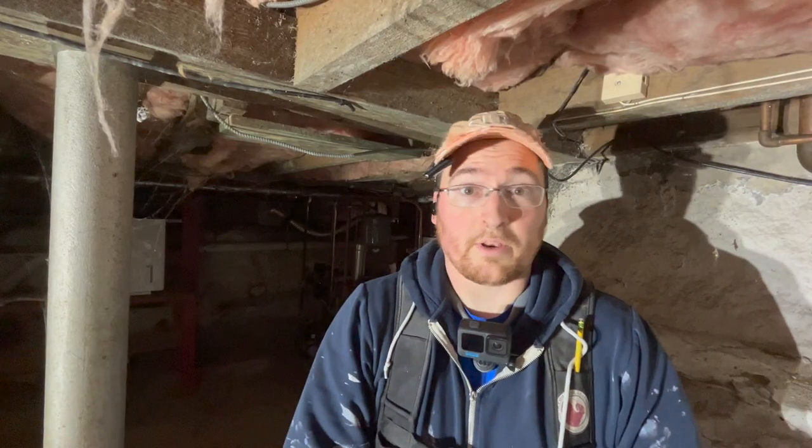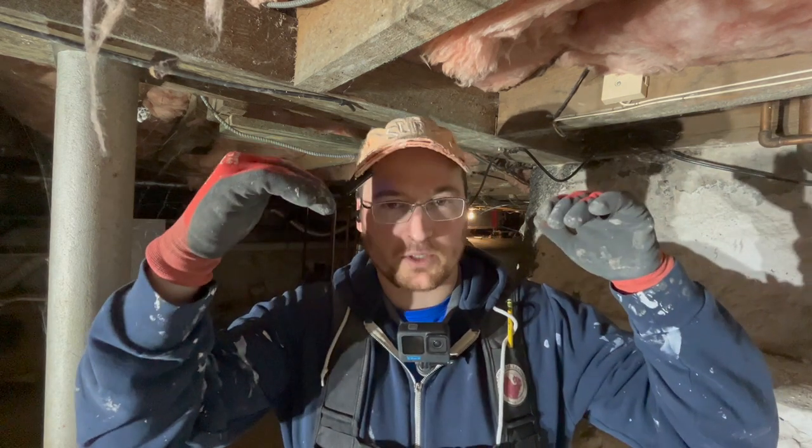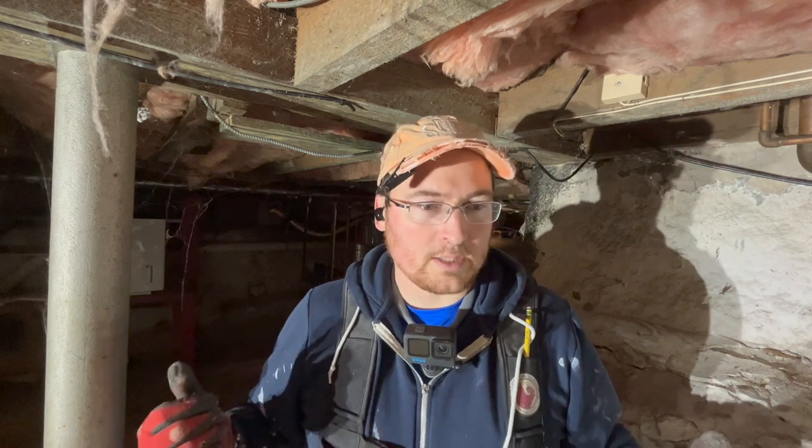That went a lot better than I was expecting. I didn't even get any poop on me, which at this point is a good day - I'll take that. The pipe came off actually pretty easy. It ate through a whole battery just doing those three cuts. What was kind of funny was I was expecting a slog getting the angle between where I was standing and where it went up vertically through the floor, but it was like 12 inches of really soft lead, which I've never encountered before. Ideally I wouldn't be cutting into a lead pipe, but I had my respirator up and it made it super easy, so I'll take it.